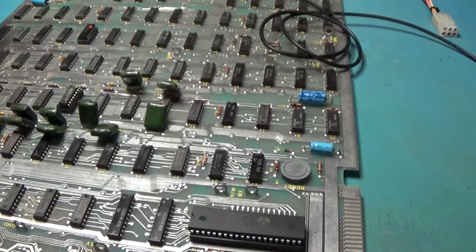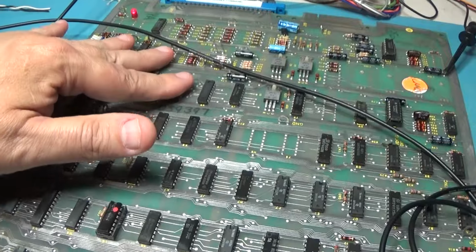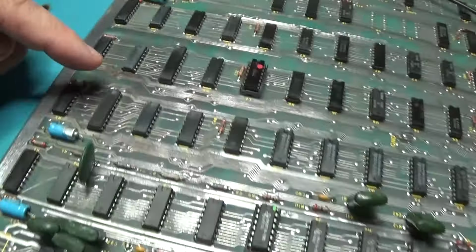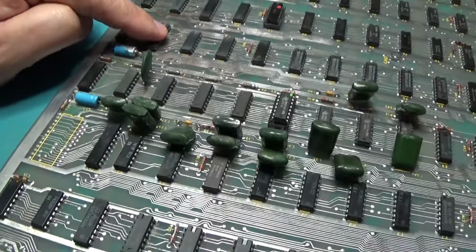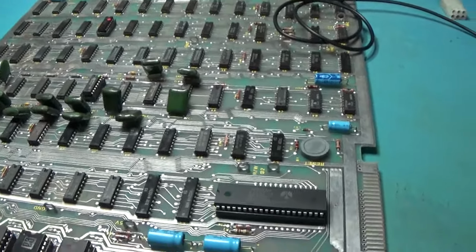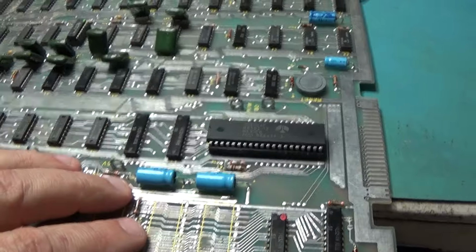So, yep. All right. Okay, we've got Texas Instrument parts here. So I'm not gonna assume those first. And then we have these Signetics parts. There's a lot of them. This one is a Texas Instruments, so I won't suspect that one. Then you got these 1, 2, 3, 4, 5 of them. I mean, it could be a Texas Instruments part, but odds are it's not. So I'm going to start with this one, and I'll clip that leg and see if it frees that signal.